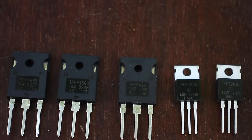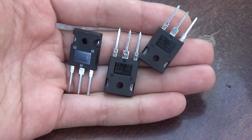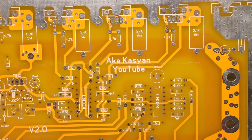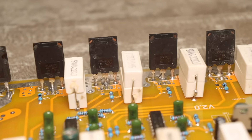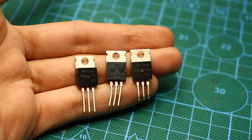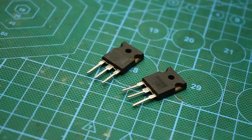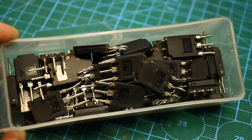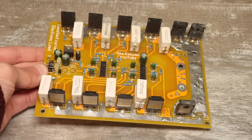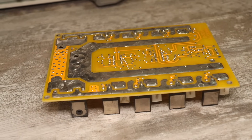That's why the larger the substrate area and overall cooling, the better. You can use transistors in TO-247 packages, and even TO-220. On the board, by the way, there are mounting holes for the TO-220 package, but the final load power will be less. With good cooling, it's safe to handle a load of 300–350 watts using 8 transistors in TO-220 packages, and 650–700 watts with TO-247 packages. The transistors I used are rated at 150 watts per transistor, but there is information that they can handle up to 300 — possibly that's true, but I wouldn't recommend taking the risk. Considering 8 transistors, the maximum load power will be within 1,200 watts.